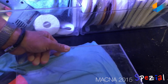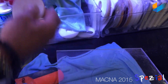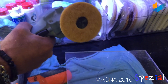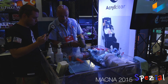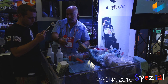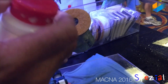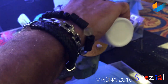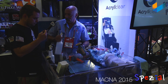So that's smooth now. Now we go to our sanding paste. This is a medium grit pad. We have a speed control — when you sand with this pad, you run at about 75% power. This is our polishing paste. It's 80 microns out of the jar, and as you use it, it reduces down to zero. So this is your partner when you polish. Use very little — just two drops is enough. And when you polish, you don't use water with soap, you use just plain water.